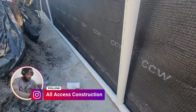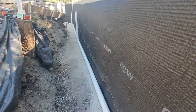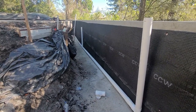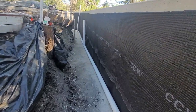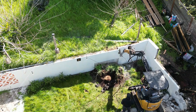This SDR 35 pipe — solid and perforated — you can see it's made in America. So you can see this is what it looks like. And this is important for any retaining wall: any retaining wall has to have a drainage system.